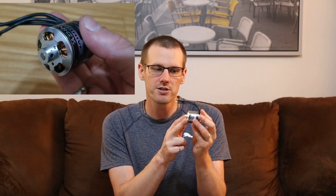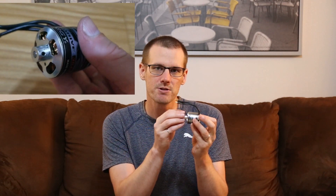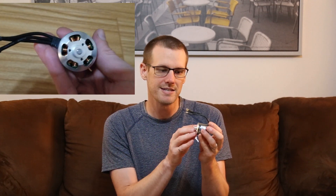On the other side, this is typically where the brushless motor manufacturer will provide a specific adapter to attach this, also providing the fasteners that come with that adapter. Because they've been provided, they should never be too long to cause damage. But be aware that on a brushless outrunner, you can fasten into both sides of the motor and you need to be aware of the fastener length for both cases.